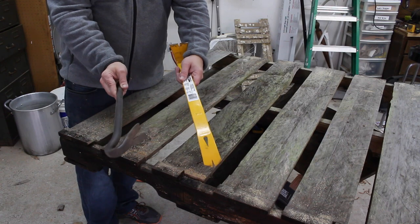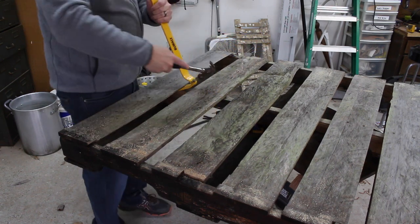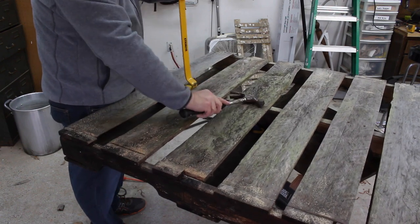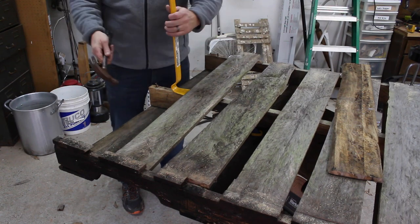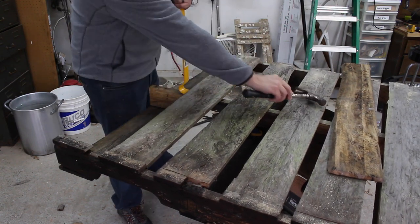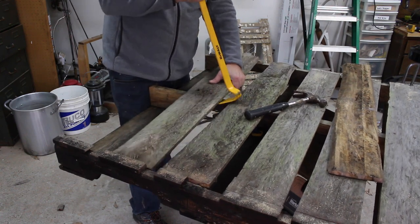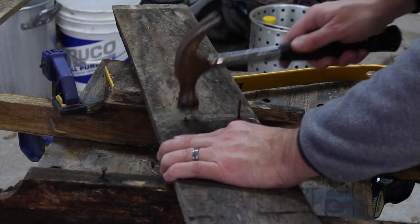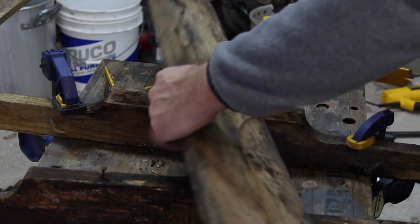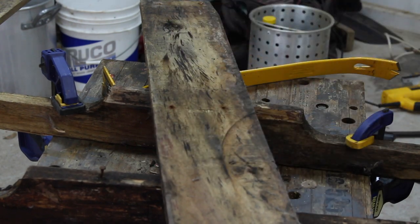Once you cut the boards loose on the ends of the pallets, you still have that middle board that you've got to contend with — you've got to pry the boards off of it. I like to grab a good-sized crowbar like the yellow one I'm using here; it's fairly long and going to give you some good leverage. It also has a flat wide area on the claw section that can easily get up underneath those nails. Just be gentle — try to work the crowbar under there, get under the nails and then pry the board off. Once you've got the boards off, take a hammer and gently tap out those nails. In some cases you might have to use a punch. One thing to be careful about is where you put the boards — you definitely don't want to leave them on the floor with nails sticking up where you can step on one.